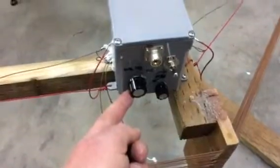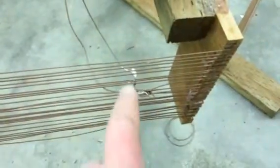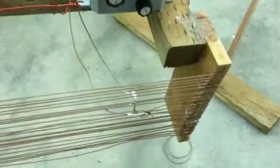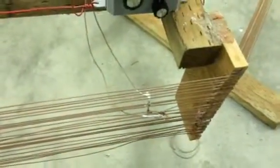We can also switch in taps. The main inductance of the loop is about 4.78 millihenries. There's a tap at 1.35 millihenries and the top tap is at 0.82 millihenries. That allows us to use it over a frequency spectrum right up into the broadcast band.